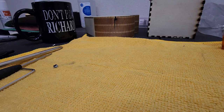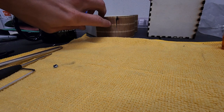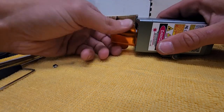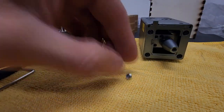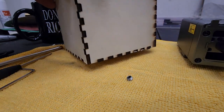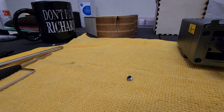I wanted to do a better video here. This covers some of the problems I've been having with my Ortur Laser Master 3 — the OLM 3 laser head, which should look like this assembled. I'm going to disassemble it now and show you why I was having so many air assist problems, why I was getting overburn and charred edges that really shouldn't have been charring so badly. I actually learned I needed to turn the air assist down or the project will move, and I was running full blast previously.